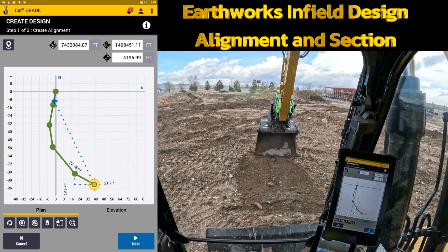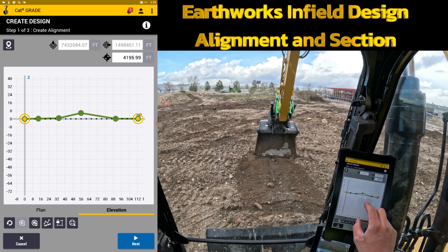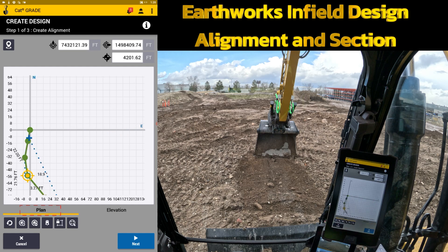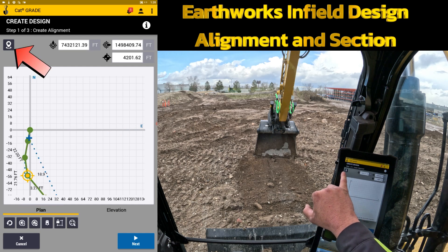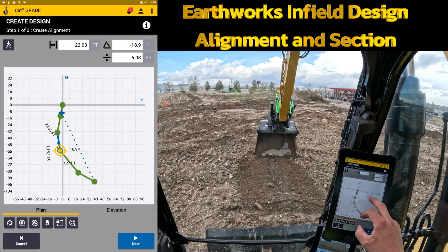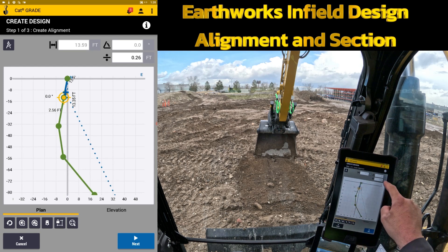Now that I've got my alignment set, you do have the ability to edit these. On the right bottom here you can see we're on plan view; there is also elevation view. If we go to cross section, you can see where my first, last, and each one of those points was — including that one I left really high in the air. You can go to each one of these knobs and change the elevation individually. From plan view you can change northing, easting, and elevation. You can switch between edit coordinate and edit segment, which lets you pick segments and edit the angles and distances in between those.